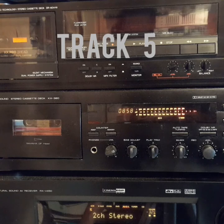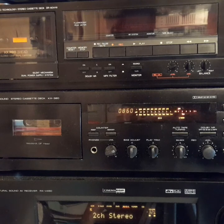Track 5, resonance checks. In this test, a gliding frequency response tone is used from 15 kHz down to 50 Hz. Because of limitations in the cassette recording medium, it has been recorded monophonically at a comparatively low level, and you may see no movement on your deck's meters at all. And because of the low level, you may want to raise your volume control slightly. However, beware of overloading your speakers. Listen for any buzzing or distortion from them, which might be signs of imminent damage.